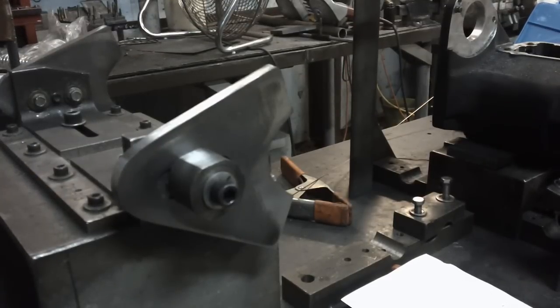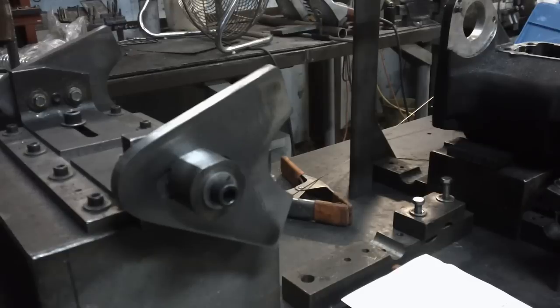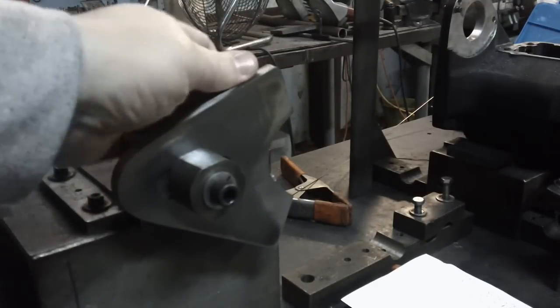But that's how I would check it on a custom build on something I don't normally do, like when somebody orders a 330 or 360, because the jig is set up for 250, 300 and stock. So we've got all these little implements for checking stuff. All right, I'm going to cut and bend up the rear end after I double check this.